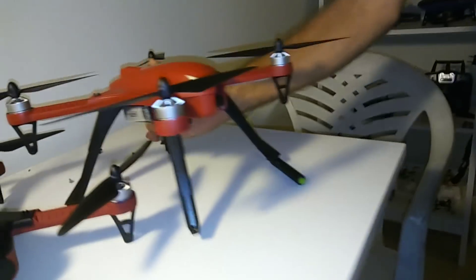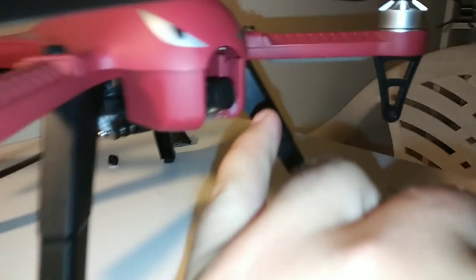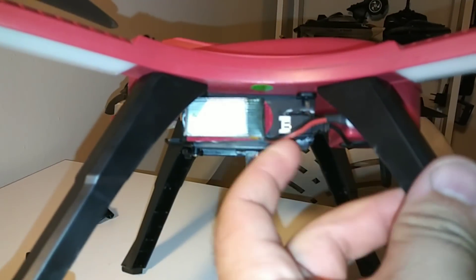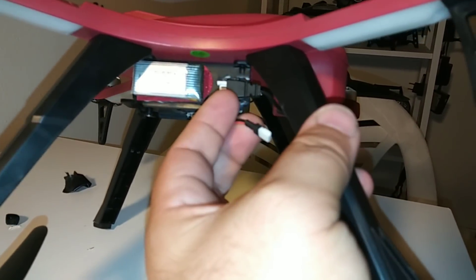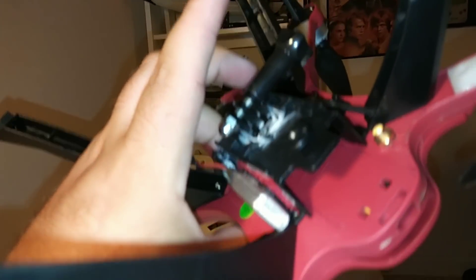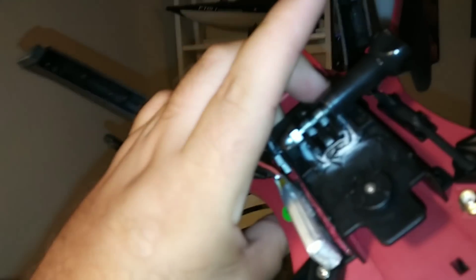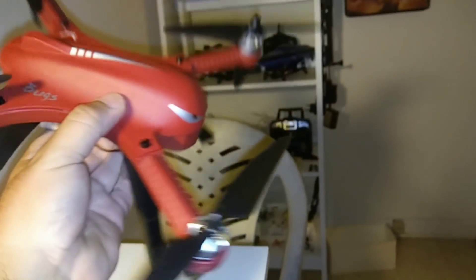Here's the comparison: he's got almost a RunCam on the front and I've got a 3-in-1 FPV camera — the FJ3. For running higher milliwatts I went ahead and put velcro on the back with a 3.7V battery so I can plug in to run 100 or 200 milliwatts instead of off the LED port. On the back I've done the same exact SMA connection. And look at that — an actual GoPro mount, the only way to get no jello.